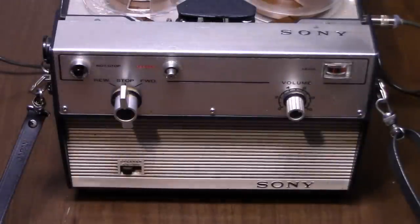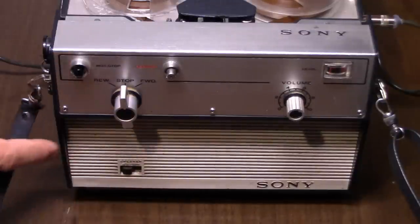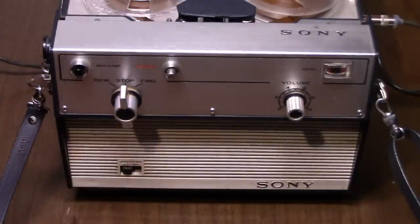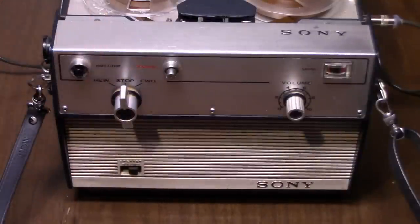Now you may have heard a loud peep when I did that. That's because of the Larsen effect taking place, because if you want to record while you have the docking station, or the SSA-905, hooked up, you have to turn the speaker switch off. Otherwise, you will hear the microphone's signal coming through the speaker like a public address system.